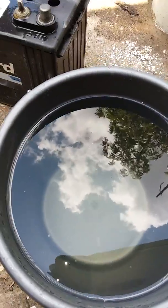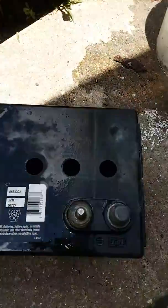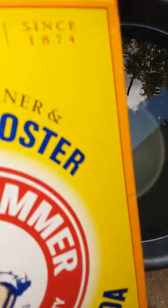I've gone ahead and taken all the acid out of the battery. You can see down in here the cells are dry. I've gone through and rinsed it out once with just water and got them as clean as I can. Now I've come back around and I've got a bucket of water right here — just plain water — and I'm going to use baking soda.